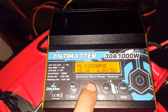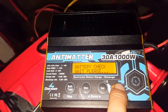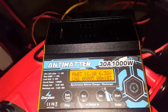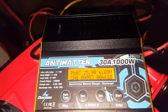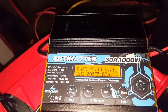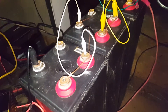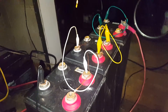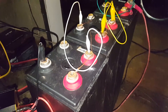Now that it's stopped, let's go for charge and punch that power back into them. Don't discount something you see at the scrapyard. Even with the voltage drop and leads being hot, being realistic it could have been nearly 600 amp hours — so 3.5 to 3.6 kilowatt hours. Just keep that in mind — just because they're from a scrapyard doesn't mean they're dead.